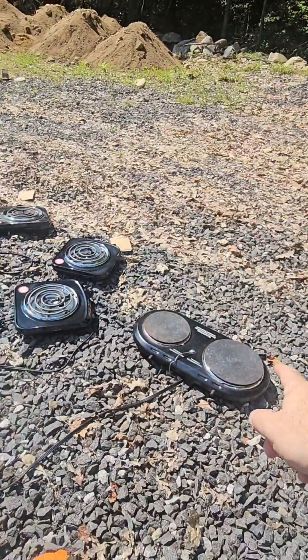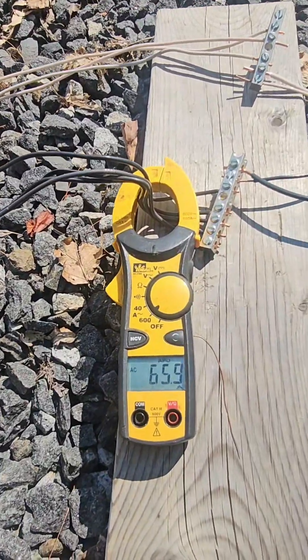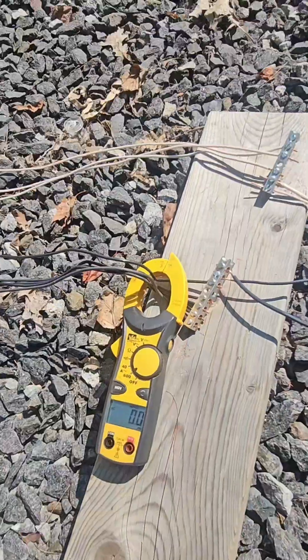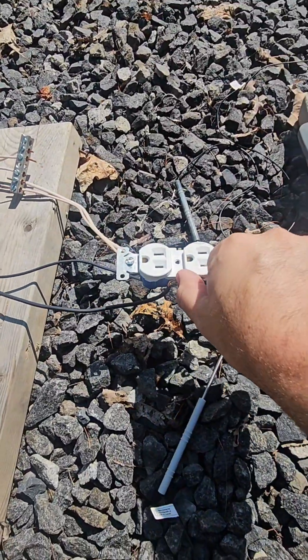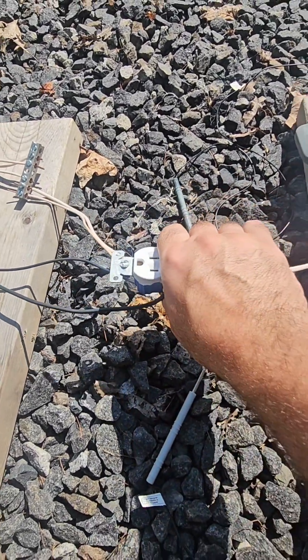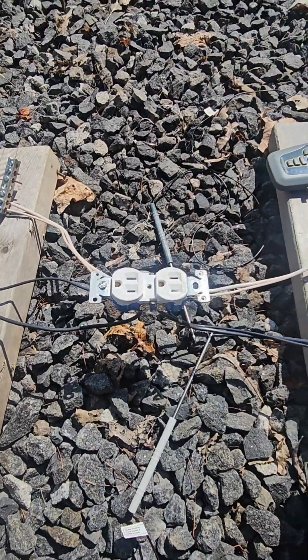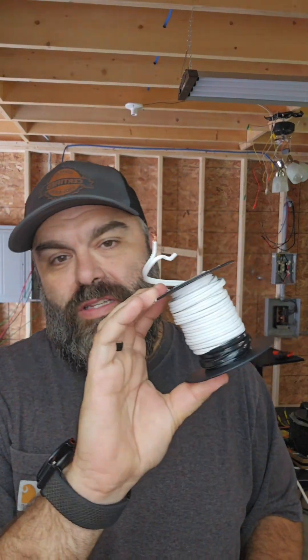The issue is, my hot plates have come up to temperature and they're turning off, so the current is now dropping below 80 amps at the peak. I've shut it down. That's not even warm to the touch — it's not even warm yet. There's no way that was even close to melting. That's amazing. I'm disappointed that I didn't get to see anything melt, so I'm going to run the 80 amps through this 16-gauge lamp cord I found in one of my bins. It's only a 15-minute test — I'm sure, not under normal use for any extended period of time, that receptacle would fail under 80 amps. But yeah, that's pretty amazing.